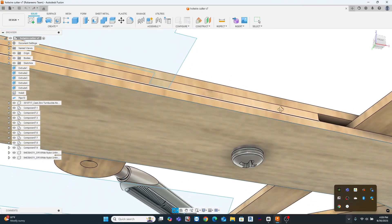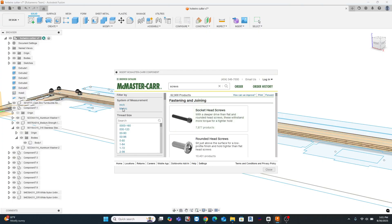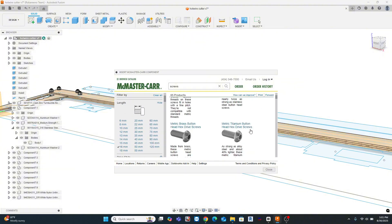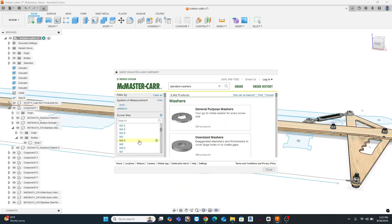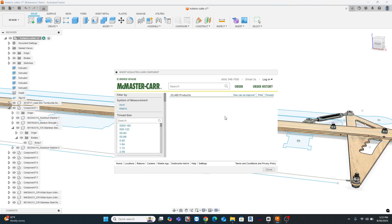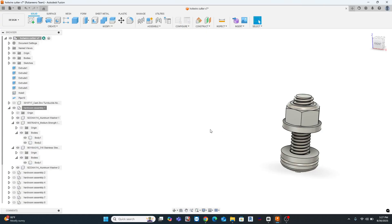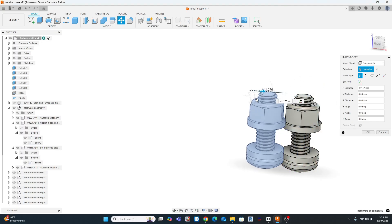So let's get the hardware required. Next, we're going to use the McMaster Carr component list in Fusion 360. After taking a couple measurements, I decided that I wanted to use 6mm threaded machine screws. After deciding the thickness of my material — in my case it was 4mm plywood — and there's a stack of three of them, then accounting for the thickness of the washers and the nut, I decided on my length of screw. I also need washers, and I use corresponding locking nylon nuts. Just bringing in one component like this is not a big deal, but your project could get messy fast if you start bringing in multiple bolts or screws. What I do is make a component specifically for the hardware, then nest all the other components within it. Since this exact assembly repeats, I can simply duplicate the master hardware component.